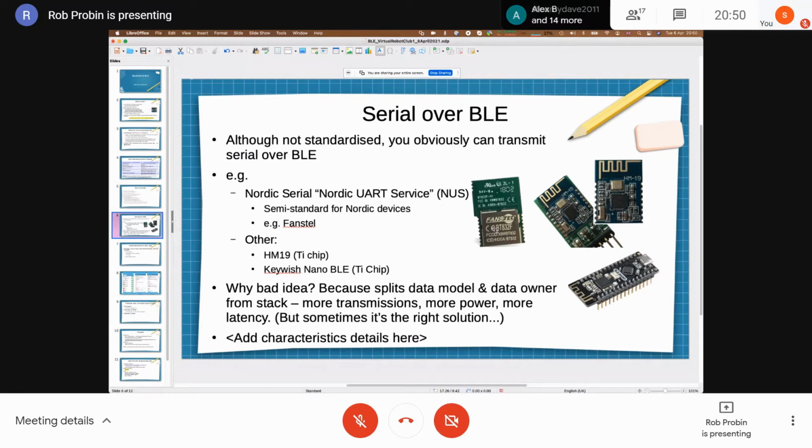The only problem over a standard Nano is they didn't put the resistors between the Texas chip and the Atmel 328. So I'm not sure how well it'll take to be double driven from an external interface. From a theoretical point of view, I'm sure the Bluetooth people would tell you that it's a bad idea to send serial over BLE.